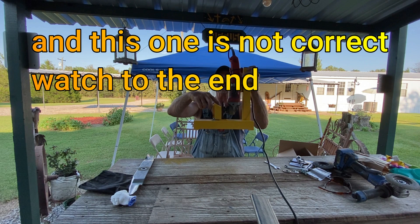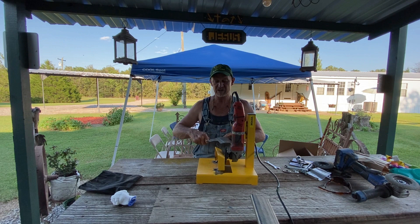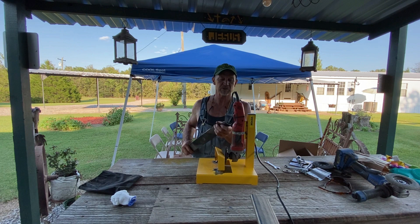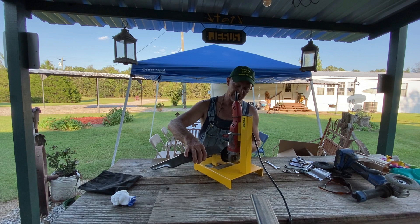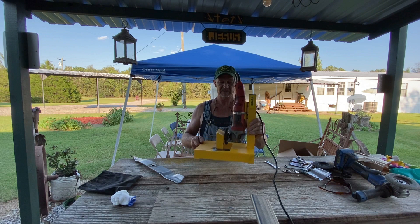The purpose of this is — it's got your 30 degree angle, which is what your blade is supposed to be sharpened at. All my life I just used a hand grinder and sharpened them — that was doing my personal yards. But now that I'm doing a yard care business and sharpening blades once a week, as you can see on this blade here, it's got off. It ain't near about 30 degrees anymore.